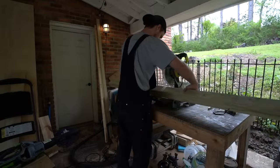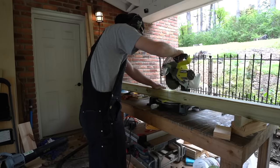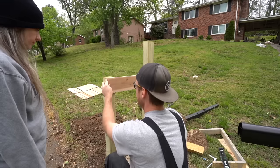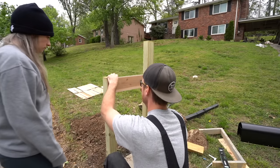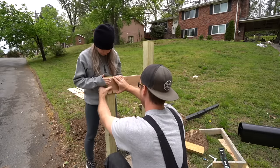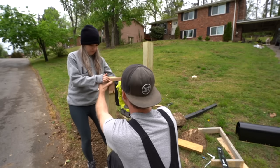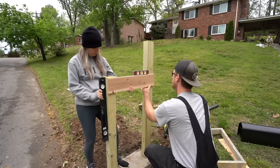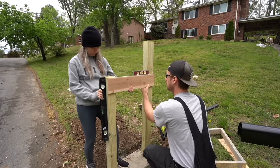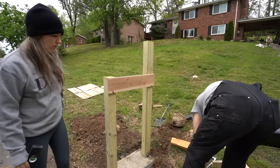The height of our mailbox — the minimum is going to be 41 inches. That front 4x4 post is going to be 41 inches in height. The back 4x4 post we're going to set in the post base and cut to height later. We do have our first dilemma: that front 4x4 post is not perfectly level. The remedy is to use our cedar trim piece — make it flush to the front and top to make it level, then pull the 4x4 post back and attach it to the cedar piece so the front post is now level.